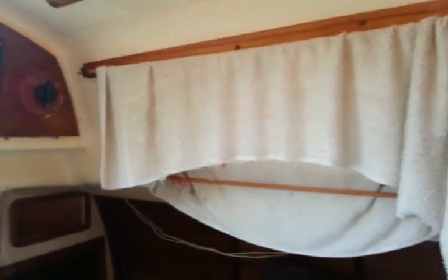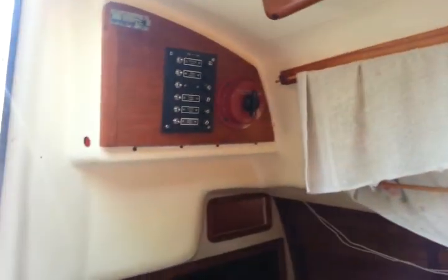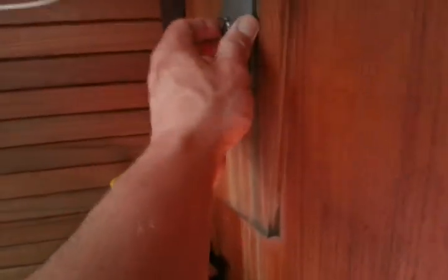Not bad considering that's 10 years — it's just starting to leak, so for me it's like this boat is in great condition. However, I do have one major leak spot right here. I've got to replace this — this is going to be a job and a half because there's a bit of rot in there, I can feel it, right up to about there, so this has to come out. That's right where my chain plate is. My other chain plate's not bad — it's pretty good. You can see there was a bit of leakage there but structurally it's good. Over here there's actually no leak at all.